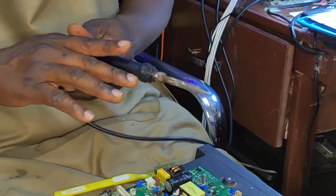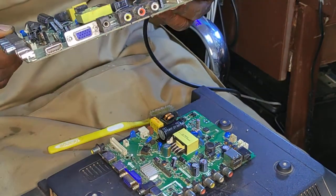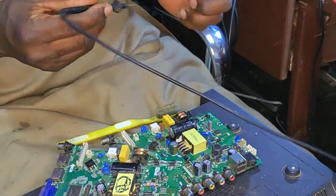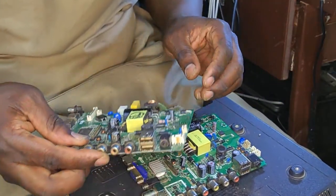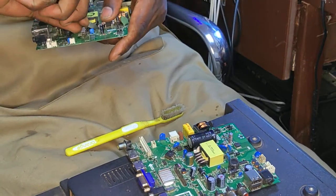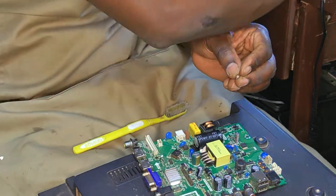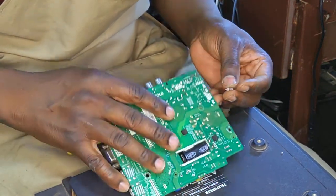So we just finished replacing our capacitor. What about that blown up resistor? Can you find one here? We have so many boards for space, so that resistor should not be a big problem. Let's check something. Let's take out that resistor. Maybe let's do the dodge way. Let's cut it, because I don't have time. Let's come with our resistor on the same point from the back and replace that blown up resistor. Same color code, same resistor.